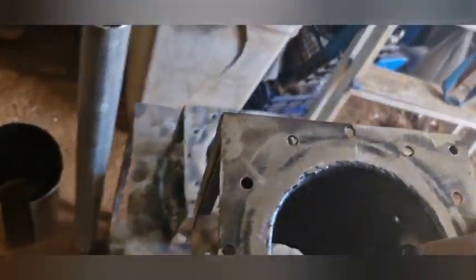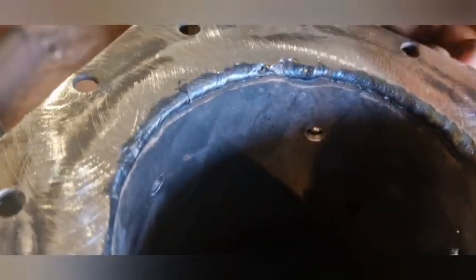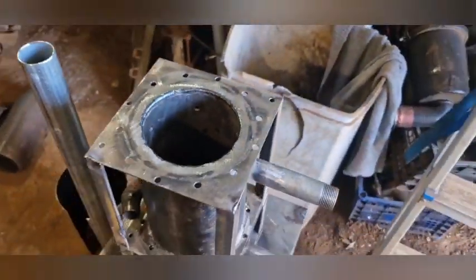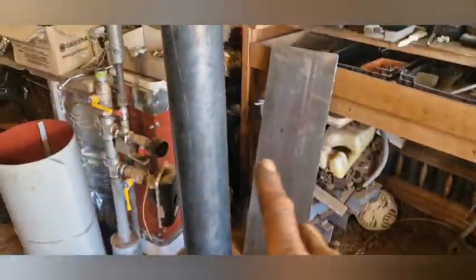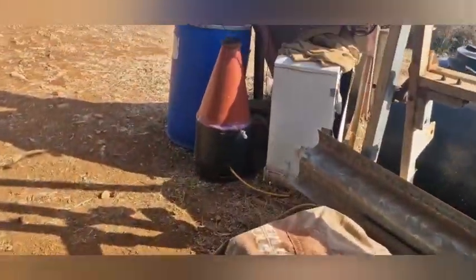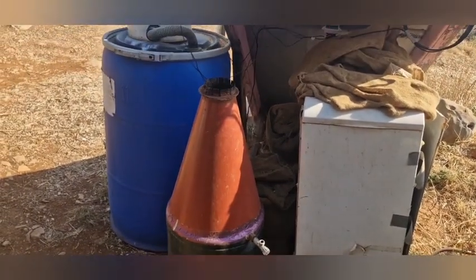This first stage can also be closed and opened, and then you lock it up. On top of this whole thing together with the hopper, it's going to be three meters high — pretty remarkable. It will go through the roof by about 350 millimeters. With the hopper on it, this is about 50–60 liters, estimated to be about 15 kilograms.